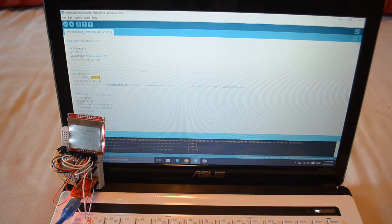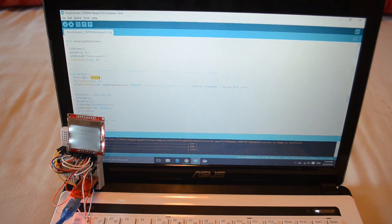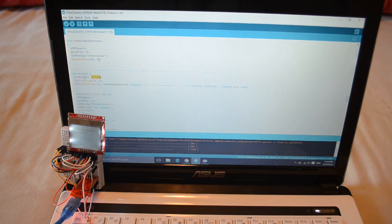So make sure to get that right. Second key point: after you finish all the processing in the interrupt function, you're going to need to put it back to ground if you're using rising mode. If you're using falling mode, you're going to need to put it up — so it's basically ready for the next interrupt.